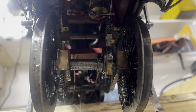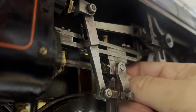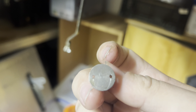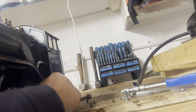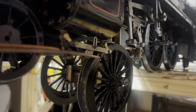There's plenty of movement on that eccentric so now they've dropped out of the way. I should be able to come up here and push that out. I can - and move it out the back there we go. A convoluted way of doing it but we've got the pin out. And now we see the back - there are actually two drive pins in it, so if you'd had the right circlip pliers you could have held that from the back all along. And of course around the other side should be the same trick. Yes - so that is the rods all off. Time to investigate the little end.